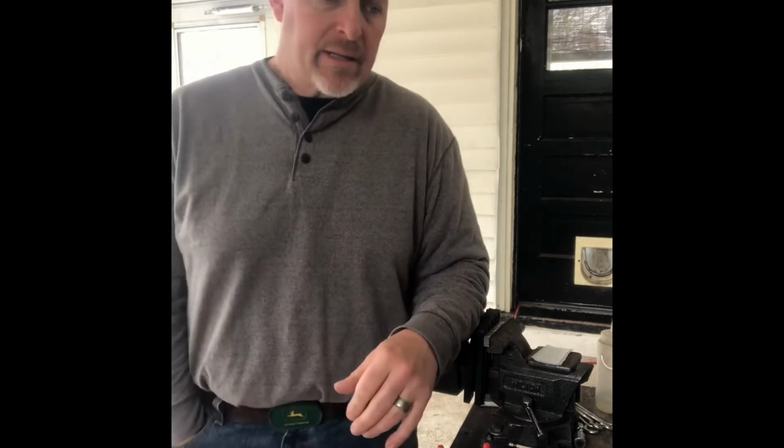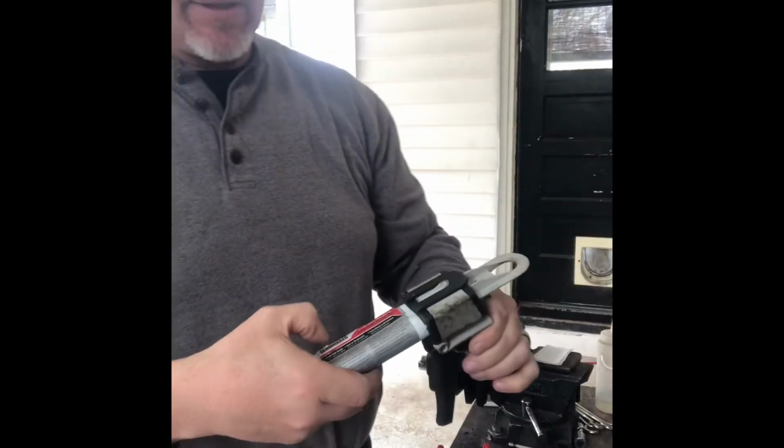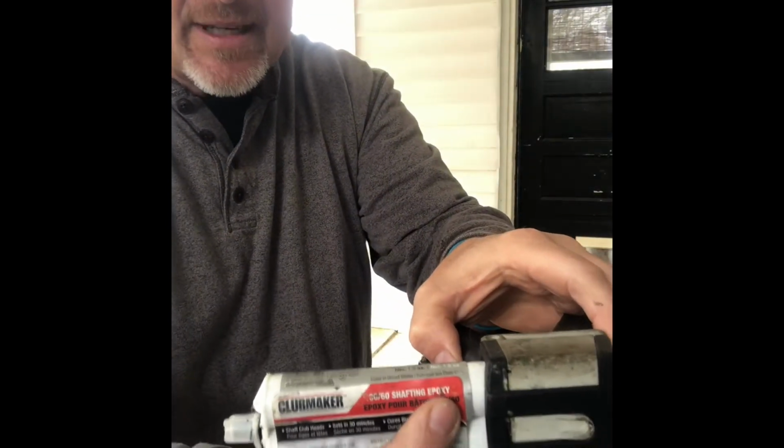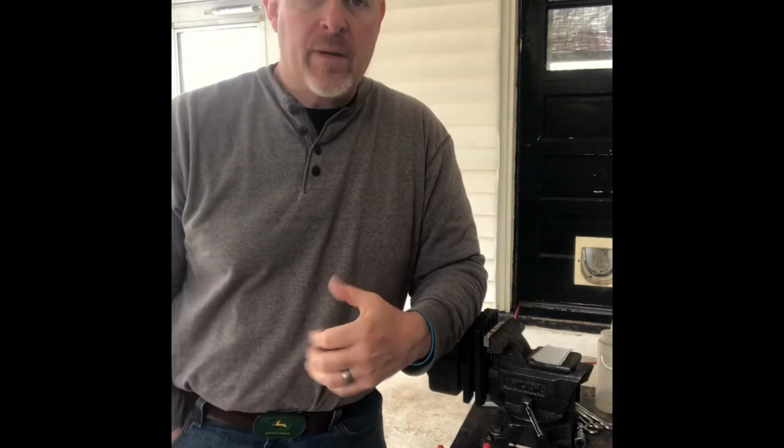So what that basically means is a lot of times when you see epoxy, I think I have another one here, you'll see two different things. You can't quite read it out, but make it out. But right there, it'll say 30, 60. What that means is that first number is what they call set time. So that'll be when the epoxy won't be able to work with it anymore. It'll start to harden up, or what they call gel. And once it starts to gel, there's no going back. You can't. It's wasted after that point.